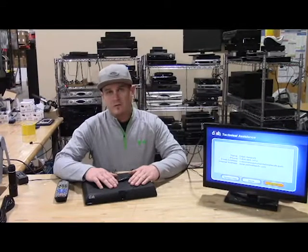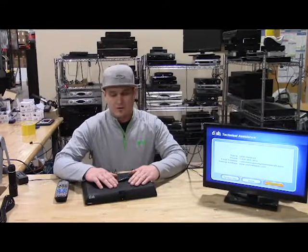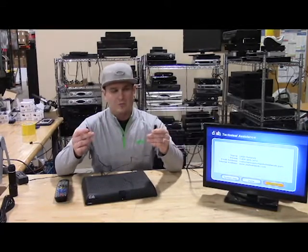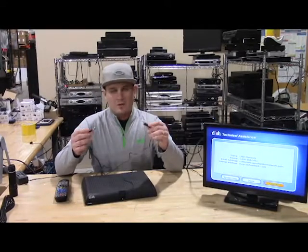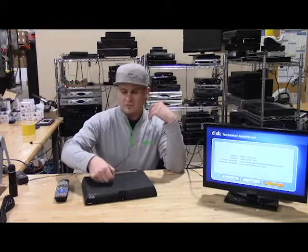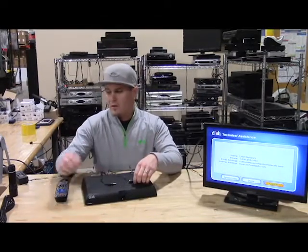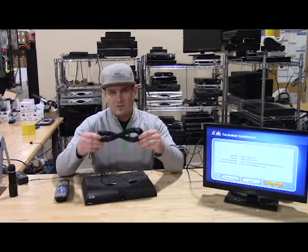Earlier in the video, we discussed how the 2-head and the 4-head repeater cables are different from the single head in that the emitter cables plug in to the rest of the kit via 3.5mm jack. That's so that you can actually extend the length of your emitter cables if they don't currently reach the devices you're looking for. To extend the length of your emitter cables, you're just going to want a 3.5mm headphone extension cable.